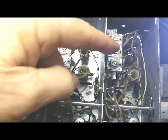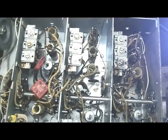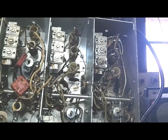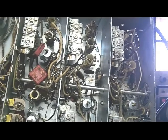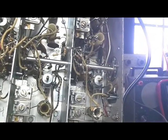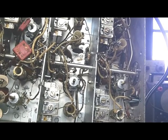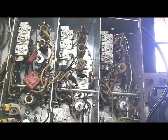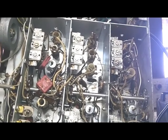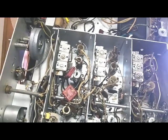I've mounted band 2 coil. This is actually band 5, so I've repaired and mounted that. So I started out with band 5, that's the 50 megahertz band, and essentially I never heard a sound on that before I started doing coil repair. So at least now I'm on band 5. I'm getting some carriers. And I think I can barely hear an image there. That sounds like maybe a TV station or a radio station or something. It's an image. But band 5 is working now, and I'm getting signals and carriers, and so that's good.